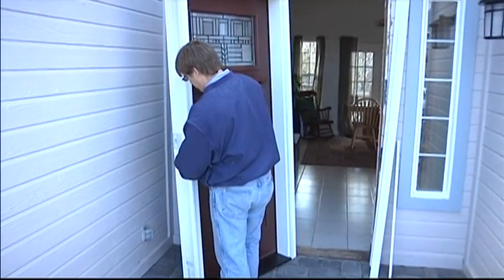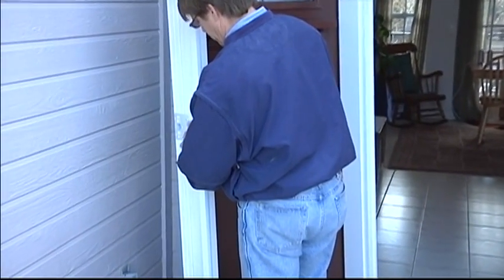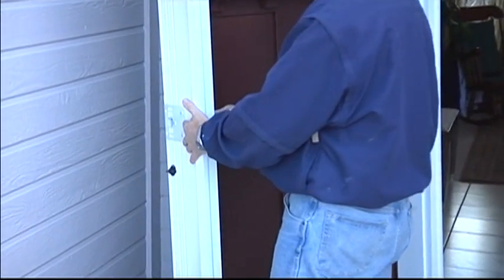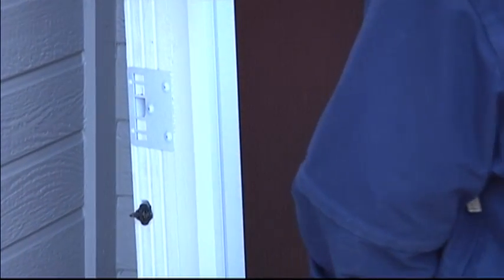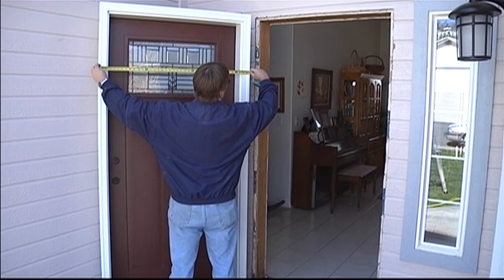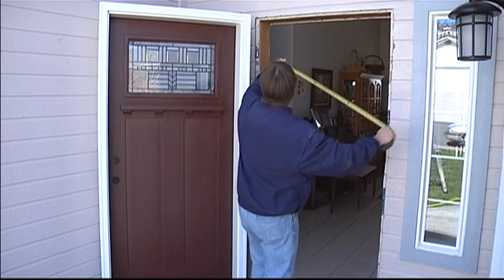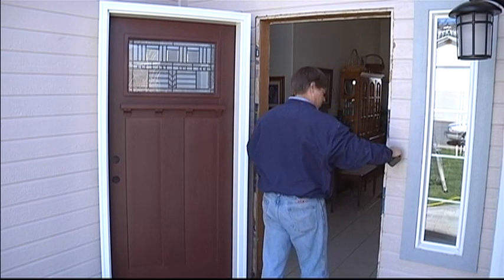This pre-hung door came installed with a security plate on the outside of the frame at the latch. Do not remove this, as it reinforces the deadbolt. We also leave the pre-hanging clips attached throughout the majority of the installation to hold the door system aligned and closed. Measure your new door to confirm that it will fit in the opening, verifying the width and height are accurate.